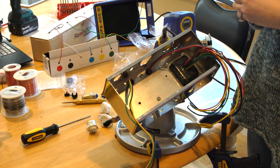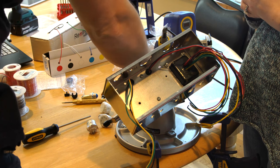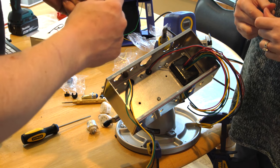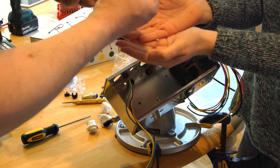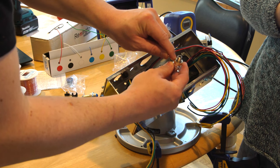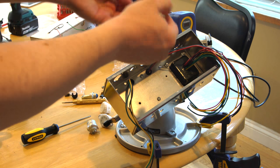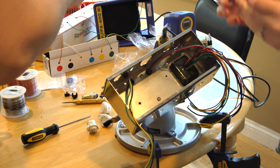These jacks come with a washer that helps keep it nice and tight, and then the nut. So you effectively put this through the chassis — you need to drill a hole normally the size of this thread. There's a small lip there — that's what you want the hole to go through so it fits flush. You drop this in and screw the nut down on top. Let's go ahead and start fitting those now.